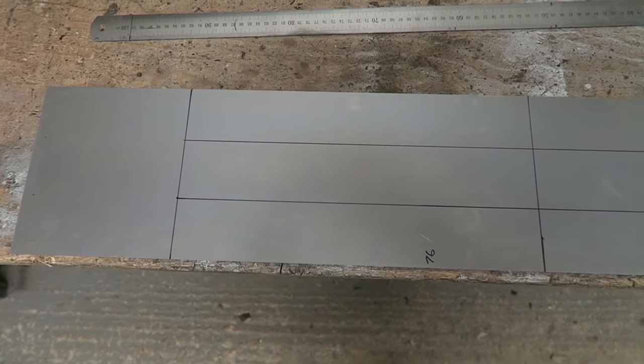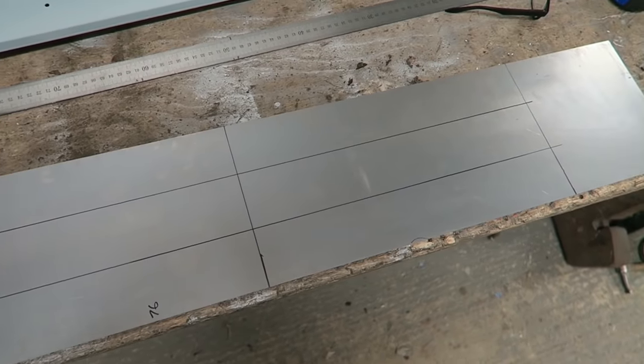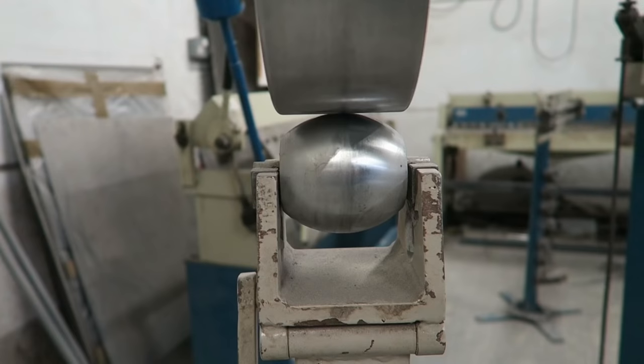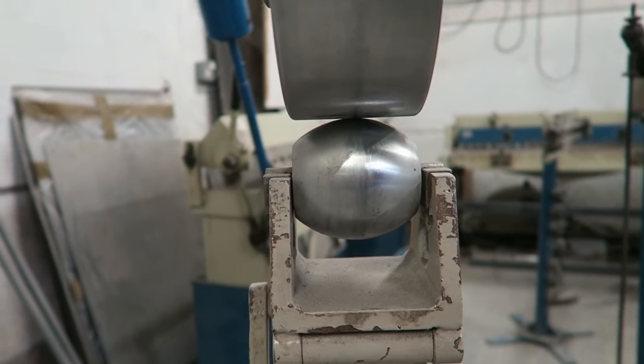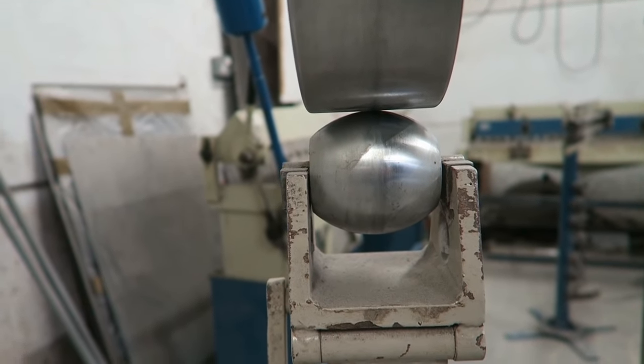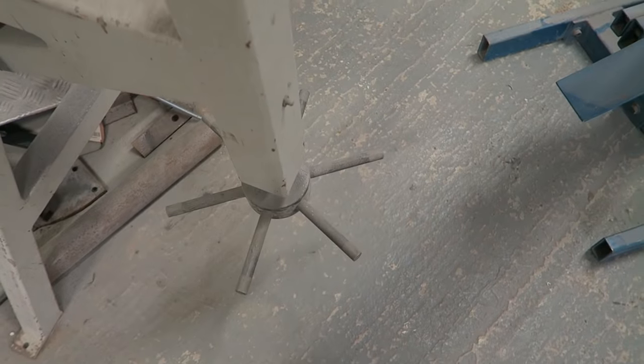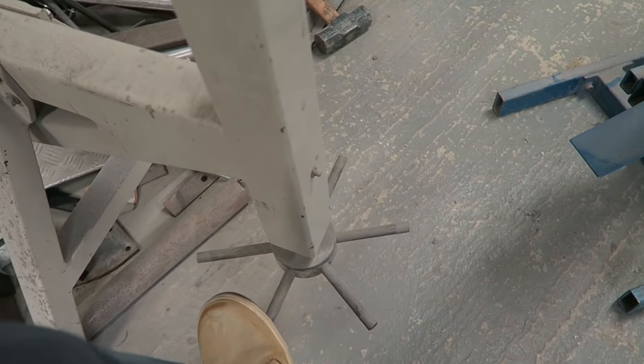So we've got our piece of metal here marked out with a Sharpie, and this is where I'm going to bead roll along those lines. I'm going to use the highest crown wheel we've got on our wheeling machine to pre-stretch the material. I'm going to put moderate tension, not too heavy and not too light. We don't want to be doing 100 passes, but we don't want to veer off the line and also put an awkward second line in that we've got to try and disguise afterwards.